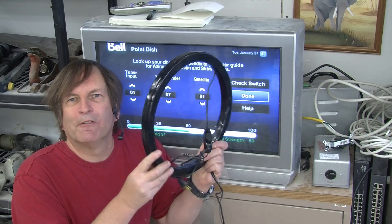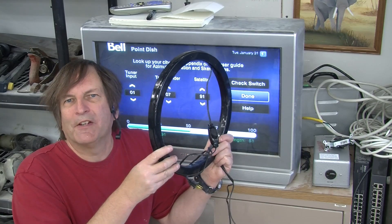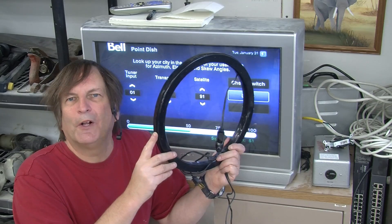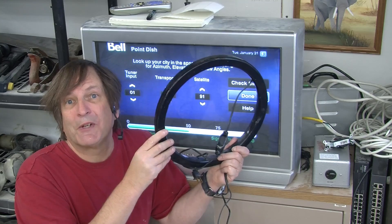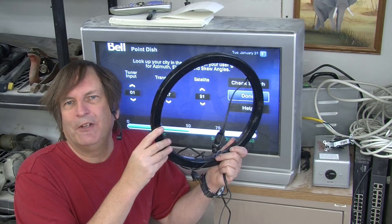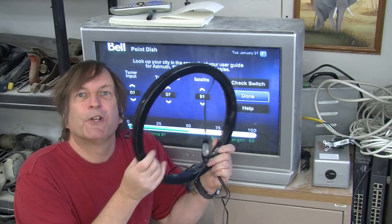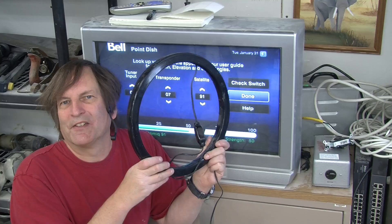There's one other way to demagnetize things besides using magnetic fields produced by a coil, and that is by overheating the magnet. If you look at any number of online sources, you can see each magnet type typically has a well-defined and well-known Curie temperature. If you heat it above that temperature, it ceases to be a magnet, and if you cool it down, it will have lost all its previous magnetism. That's not usually a problem because it's usually many hundreds of degrees Celsius, but it is something worth knowing about. So there you have it — that is everything about demagnetizing magnets. Hope you enjoyed it and see you next time.